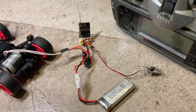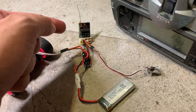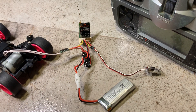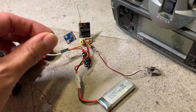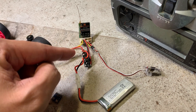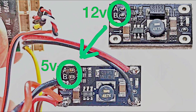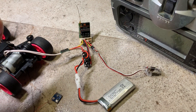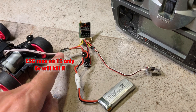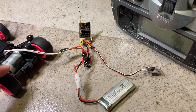In this shot, you can see how I've wired up all the electronics for the MK2 build of the RC Tamiya car. The key difference from the previous build is this component here — it's a step-up regulator and it steps up the 4.2V to 5V in order to run the Spektrum receiver. This is the AR6300 Spektrum receiver. I mentioned I wanted to use a micro Spektrum receiver but I damaged it due to overvoltage — I didn't realize the step-up regulator outputs 12V DC by default and I needed to desolder 2 solder taps to make it output 5V. So be careful: before you run any regulator or step-up, make sure you test the output voltage. The ESC and servo are the same as before, and these are the motor wires hooked up to the motor for testing.